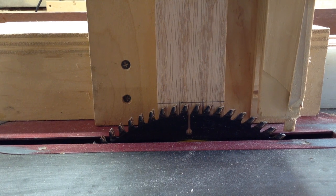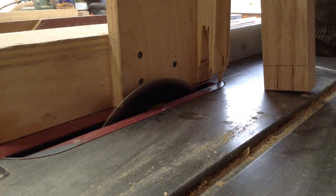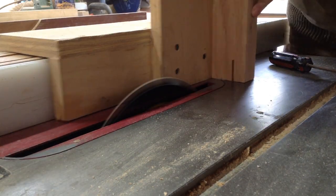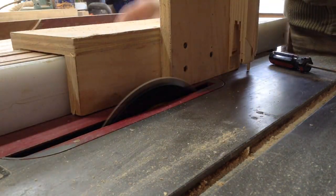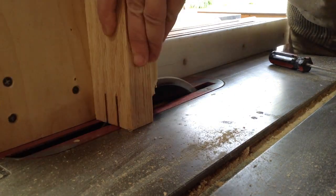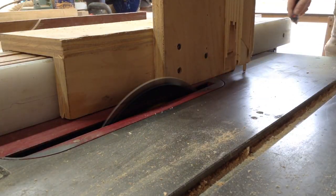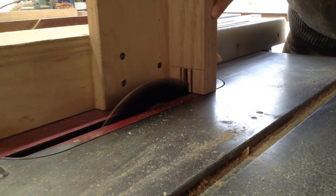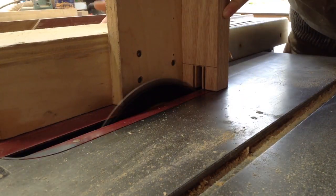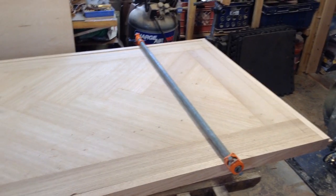I mark basically the edge of the tabletop, then go through and make what we'll call the tongue on the first piece, and this is kind of like an open mortise on the end pieces, just using those marks. I have a tenoning jig on the table saw so I could go through and do all these the same because they are pretty much identical. Then I just trim out that excess. When you're curve cutting into edge grain like this, especially hardwood, it kind of sticks in there because it doesn't want to flake off, so I did remove a lot of material. Then I have this roughly clamped into place — you can see it's a little bowed, but it's going to make a nice outside frame.